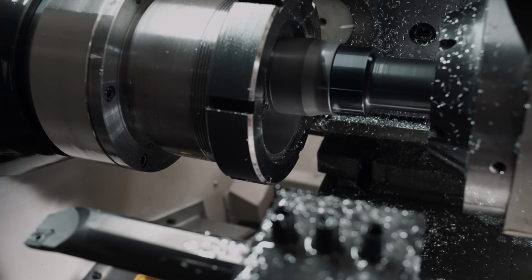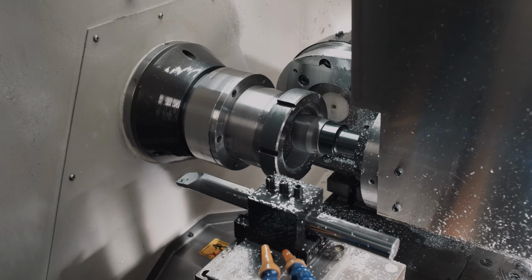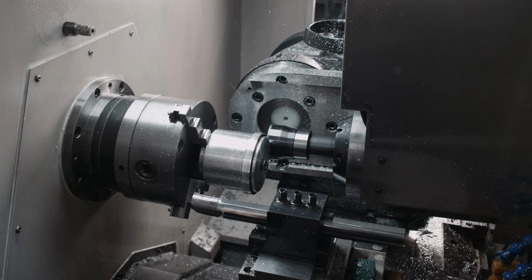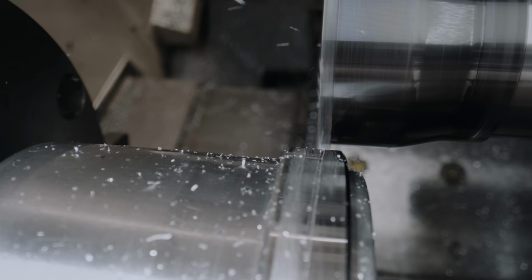Modern autofocus lenses use cam systems so the servos can operate faster. Cam systems can alter the rotation speed over the focus range. That means that the focus throw can be longer towards infinity and shorter on close focus. Cam systems are technically more complex to build and to service, and if the pins wear off, the focus can develop backlash. GL Optics uses the traditional helicoid system.